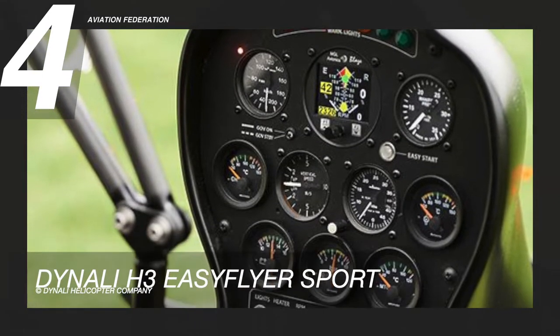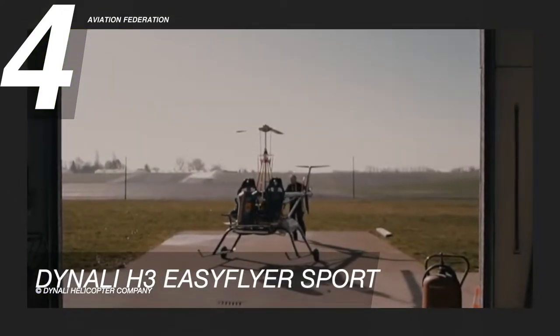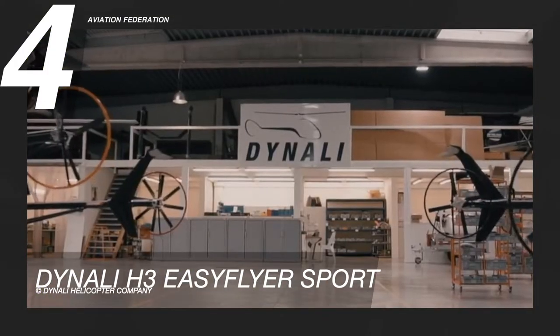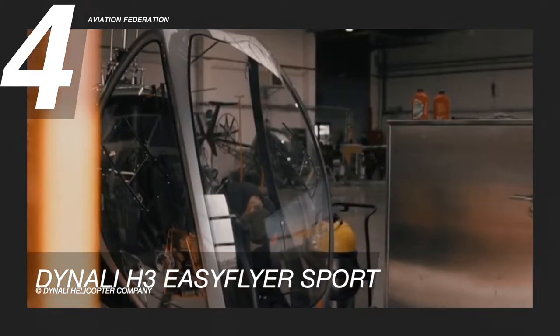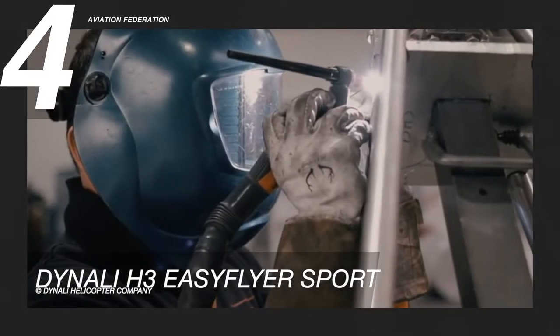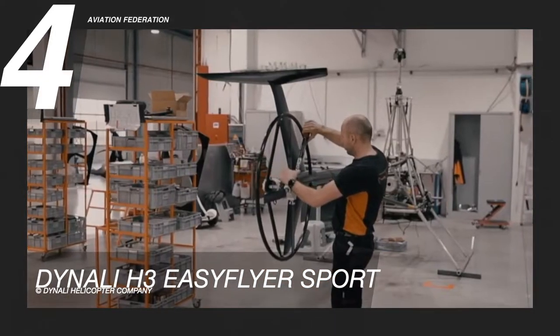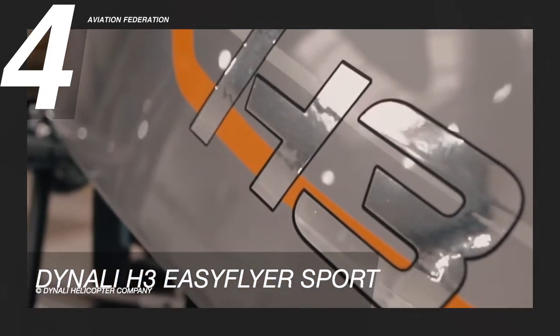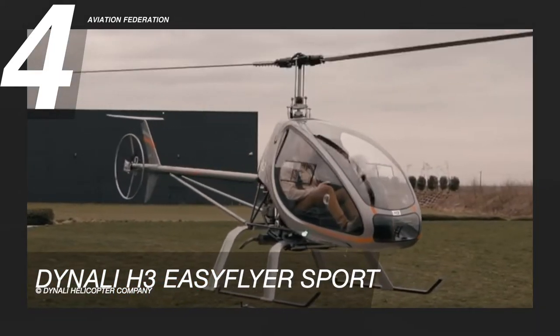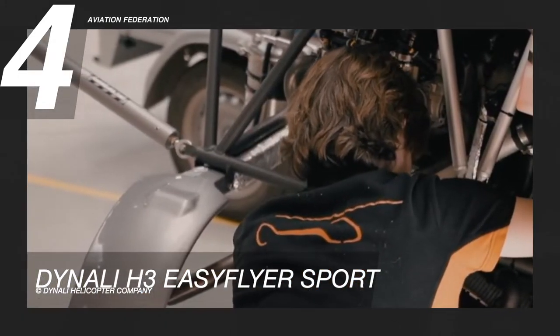All the main components including the motor unit, the cabin, tail structure, and the main and rear mechanical rotor transmission are supported by an over-dimensional tubular stainless steel frame. A swash mechanism with the leading blades made of extruded aluminum, or optionally in carbon, controls the high-strength stainless steel main rotor via rigid rods. This design brings the total gross weight to just 500 kilograms, or a little over 1,100 pounds, to fit in the light sport aircraft category. The starting price for this model costs 150,000 US dollars.